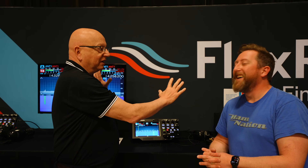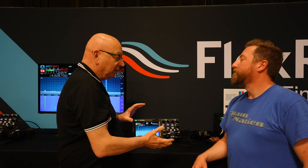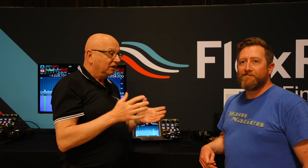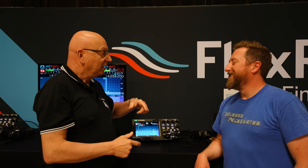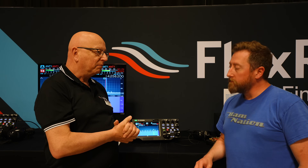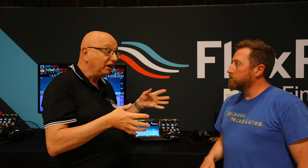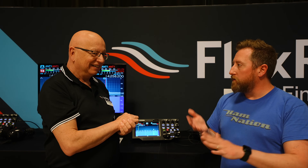You can put the radio under the desk. In Andy's case — he's standing beside the camera — he's got a clean little desk and his radio's on the other side of the wall, in a rack. A fair number of people, usually in the Midwest, have their operating station, but all their radio equipment's in a building two or three hundred feet away. That makes sense because you get to reduce feed line, reduce local interference, get more signal in so you can hear, and get more signal out.